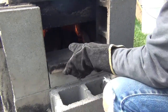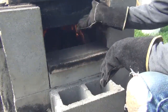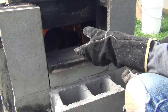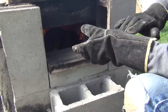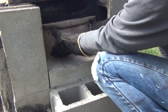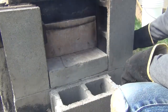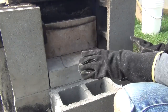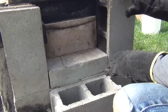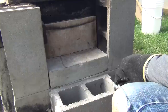The draft isn't real great on this. Once this thing really gets roaring it works pretty well, but when I'm first starting this up, I get a lot of smoke coming out the front. Once this thing gets going, it's just sucking that flame right out the vent in the back and it's drafting pretty good. When I get this closed, all the little cracks are just sucking air in. If I would have mortared this together better with real mortar instead of quick-set, made some real good mortar joints and leveled things out, this would have worked a lot better and been sealed up better.